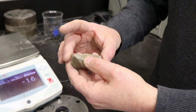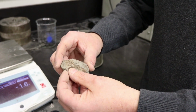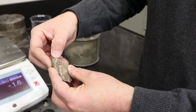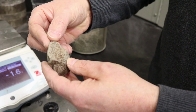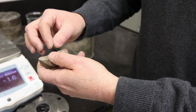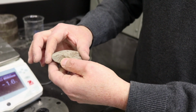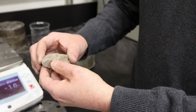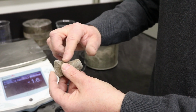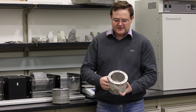One thing which we want to make sure before we start this experiment is that our samples all have a relatively random shape, just chunks of rocks. We want to make sure that we grind off the sharp edges of those samples, because samples with sharp edges have a tendency to break off those edges during the test. So it means that they would deteriorate during the test much faster than the samples which have rounded off edges.